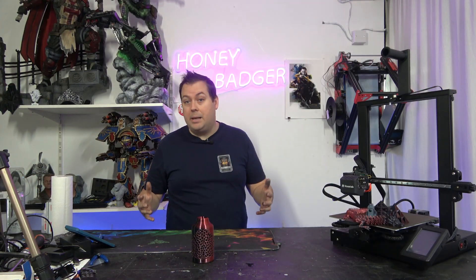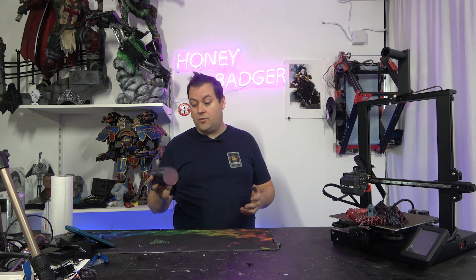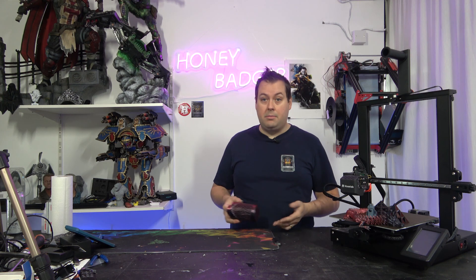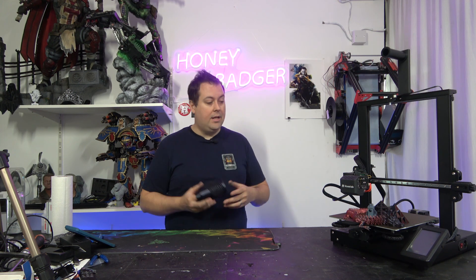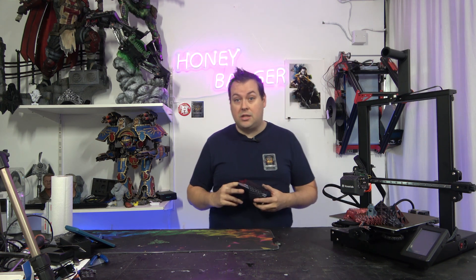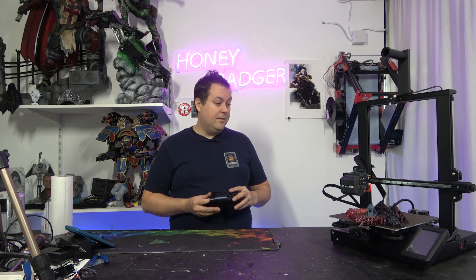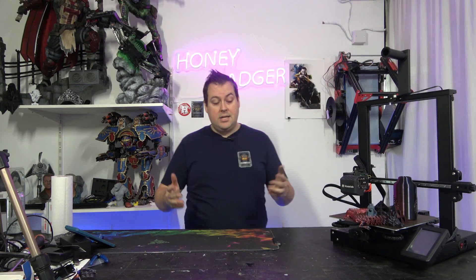As you can see, the printer is very capable. Out of the box, with a Cura profile, pretty much stock — we only changed flow rate from 100 to 101. These all printed at 60mm/s. The part cooling is fine, the extrusion flow rate is fine, the bed level is pretty good. Because this has got linear rails, you could push it faster and it will go at a decent speed. We left it at stock settings so we could show you what it would be like printing out of the box — and as you can see, it's pretty capable.